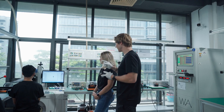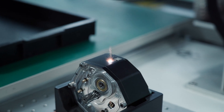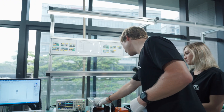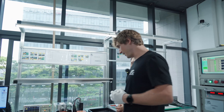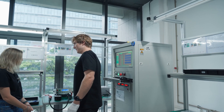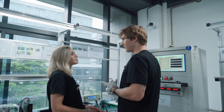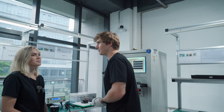After the motor is assembled, a QR code is laser-etched onto it — the motor has now been 'born.' It then comes to a test station where it is spun with no load to analyze if the three phases are normal. The final check involves a small gyroscope that measures XYZ movement while the motor runs — the QR code is scanned, the motor is run, and both decibel noise and vibration are logged, recording the motor's characteristics before it moves to the final assembly line.